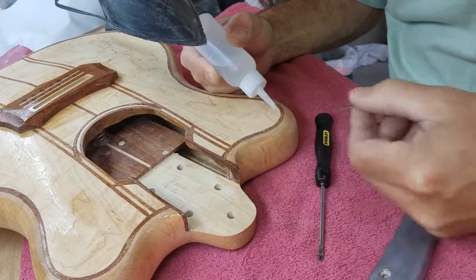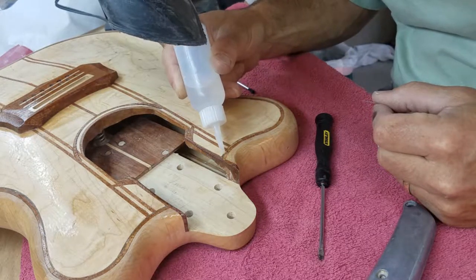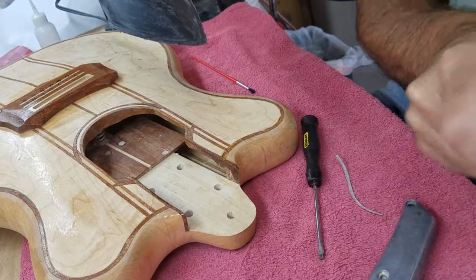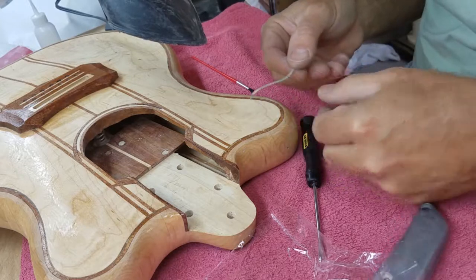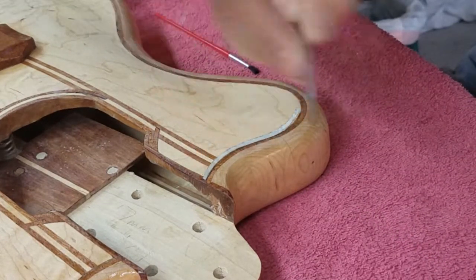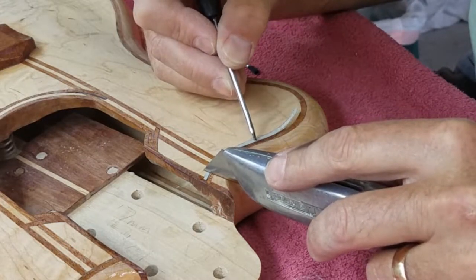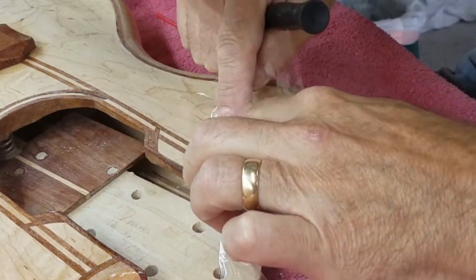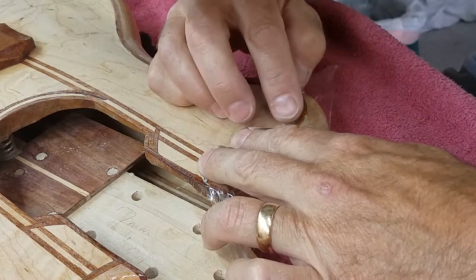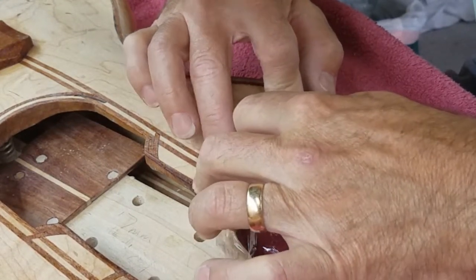Now to fix the veneer to the wood. I'm first piping a line of the thick super glue along where I want to place the veneer — don't use the thin stuff, it'll just run away and make a terrible mess. Tear off a piece of cling wrap and place it ready. Next you're going to drop the veneer cutout and float it into place. The thick glue gives it some body to rest on so you don't have to work super fast, but don't press it down hard or it will grab. Now I slide it into place using a variety of pointy things — in this case a small screwdriver and my knife. I'm just very slightly overlapping the mahogany beading underneath so there is no lighter colored maple exposed. When it feels like you're almost down and the glue is starting to grab, cover with cling wrap and press down all over and hold firmly. As you squish the excess glue out you can still make some small slide adjustments if you work fast, but be quick because it's going to set up pretty quickly.